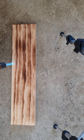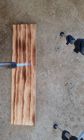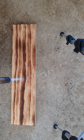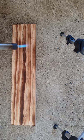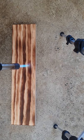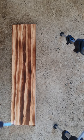You can see that beautiful wood grain coming out. I haven't done anything to prep it. Now I've got what I'm looking for, so I'll just go back — see how it's darker here? The guy whose name I'll put up explains it really well, but basically they're hot spots. It can happen where the torch is there a bit longer, but the wood might actually be softer so it takes the heat a lot quicker. It does help if you keep your torch quite even — try to — it does decrease it. Once I'm happy with the color I might just go through and darken some areas I want to work on specifically.